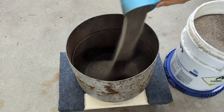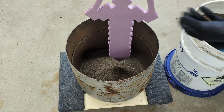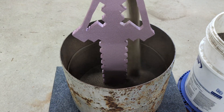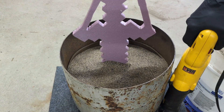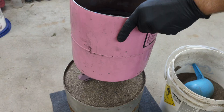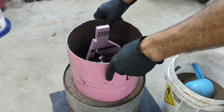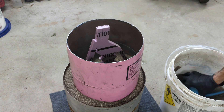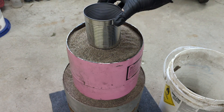If you're new to my channel, I do this process quite often. It's pretty simple — you just fill the bottom of the container with sand, put your foam pattern into the sand, and then completely fill the rest of the container up with sand. This sand has to be completely dry. It's also a good idea to vibrate the container for better compaction. Because I don't have a container that's the adequate size, I'm putting another container on top and cut the bottom and top out of it.